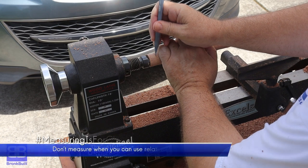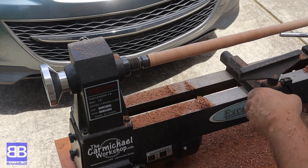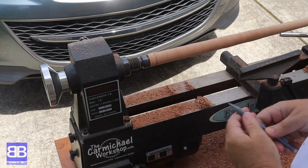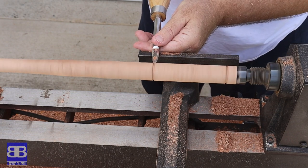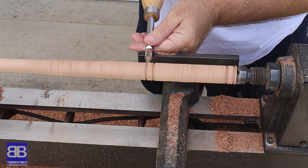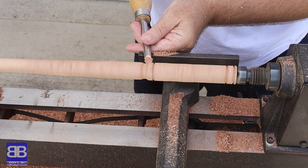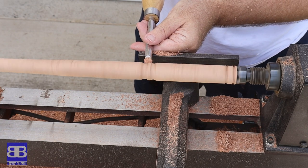I use my hand to figure out how big the handle needs to be and I mark it. From there I use the pointy bit tool to put in a couple of grooves to set the handle space. I think that tool is called the channeling tool, but I'm not sure. From there I move to the rounded bit tool and I work those channels into rounded beads on each side of the handle.